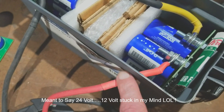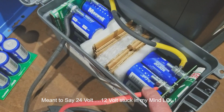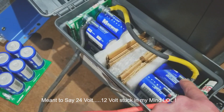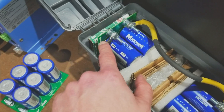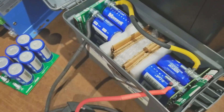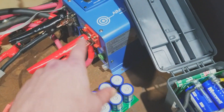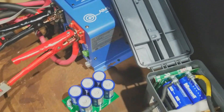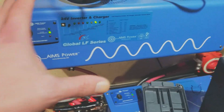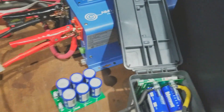As you can see, it comes in on the positive side — it's all wired in series. You've got your positive and your negative, then it goes over to your positive to connect and then right back to your negative output wire. I have this going through the clamp meter doing some testing, and I hooked it onto the end of a power inverter. This is a 2,000-watt inverter for the testing, since I can use this to test with as I've not got it on any loads.